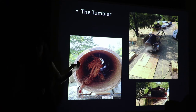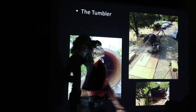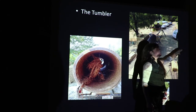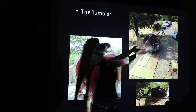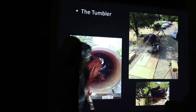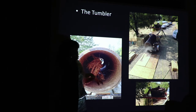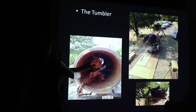The tumbler is essentially a culvert — a big piece of tubing on a little electric motor, so it's quiet. There's clay slip that gets mixed and pumped up, fed via gravity, kept in suspension. You put the straw in, it tumbles through the tube. The nice thing about the tumbler is it's quiet — a nice advantage over conventional construction. It minimizes a lot of the labor, because you can do all of this with one or two people instead of twelve.